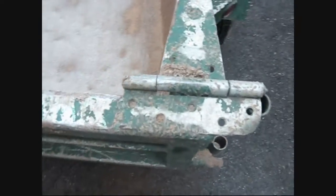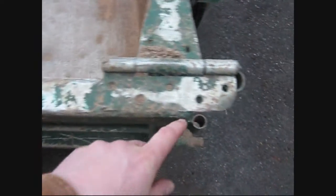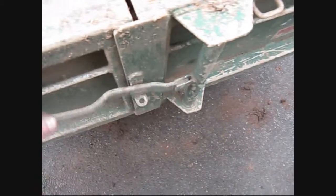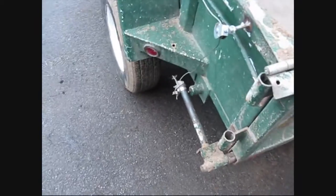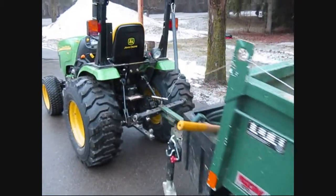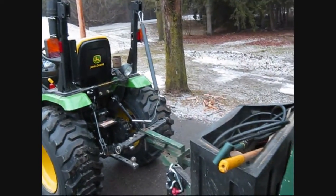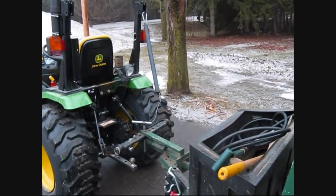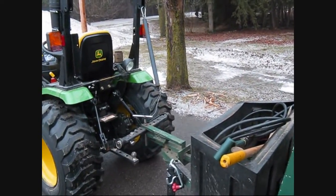I put a bar down here and welded it shut, and I got some of these great big hinges and welded them on here and here and then up around here, and now it just swings on that — it works good. I haven't had a problem with it yet. So I rigged up this opener thing here — runs the cable all the way up. Basically the spring gives it a bit of give when it goes up so it doesn't snap the cable or pull it too tight, because you don't want one of them flying back in your face. Yeah, it works pretty good.